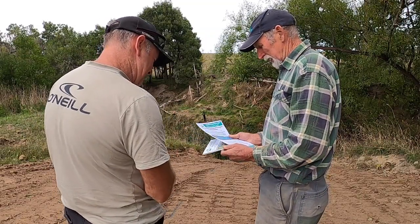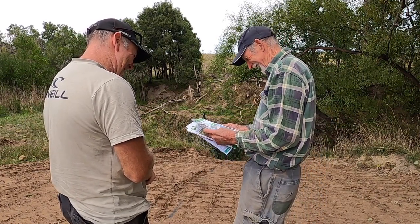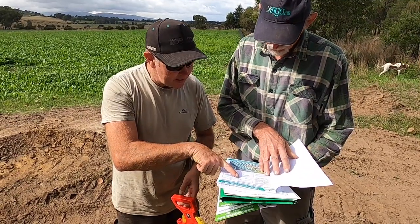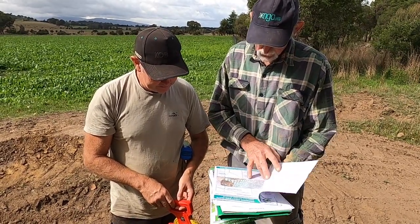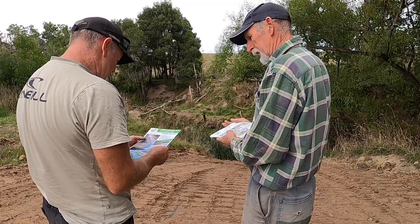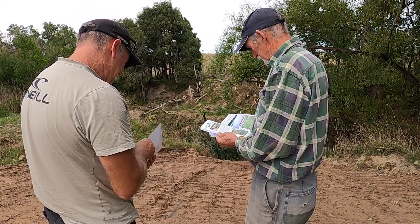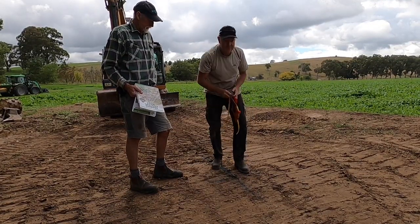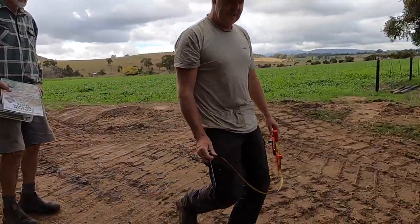Now Glen, this is all the good gear that comes with this matting — all the instructions. The instructions: when you're finished, you read them. We've got our trench. It's 450mm. So that's the sort of shape you want to finish up with here. I reckon we'll run a 1500mm shallow trench right through there. We need 15 metres — we'll mark out the 15 metres from the start of the creek back this way and work out where we're going to dig our trench to bury the start of it. We've come up 13 metres from the bottom of the worked area. We're going to dig a trench at the 13 metre mark — just so we can bury the material so the water doesn't get underneath the matting and wash the soil away again. It's okay if it percolates through the matting; it's not okay if it gets under the frame. Now we're going to dig a shallow swale drain, about 800 to 900mm wide, just so the water concentrates in the middle — and having a tilt bucket to do this makes life a lot easier.